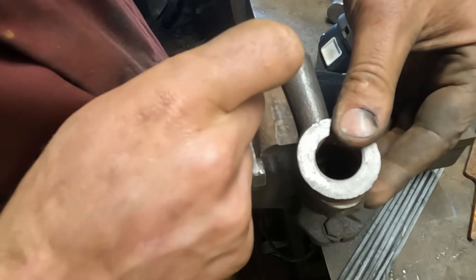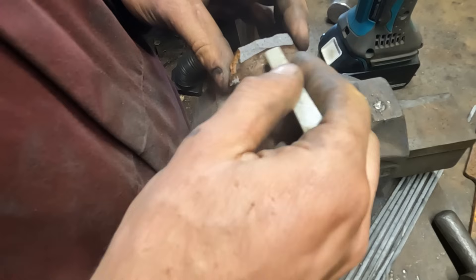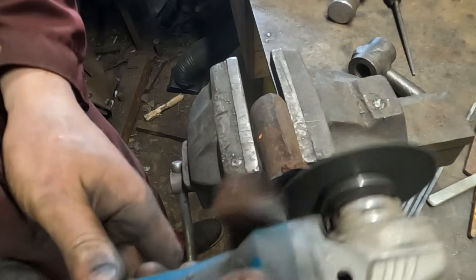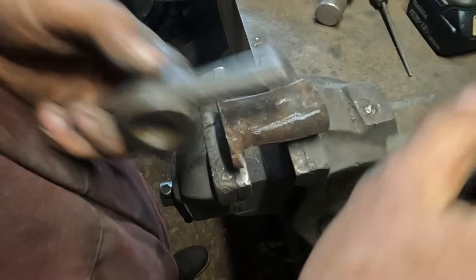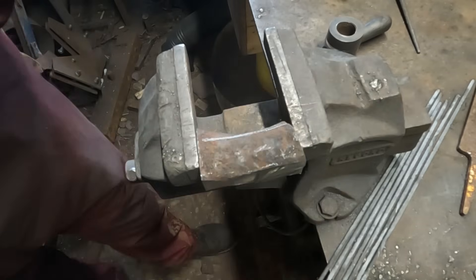I'm making the new lever with this piece of broken pulley, which is also cast iron, probably of a similar age. I like to use similar metal to the original part for repairs like this because they weld together nicely and also finish and tarnish in a similar way. For me this makes it worth the extra time roughing a piece out from scrap casting.